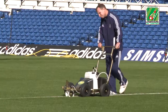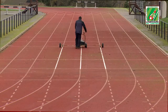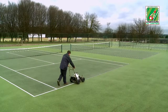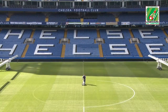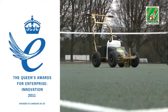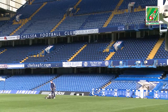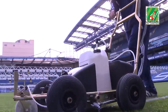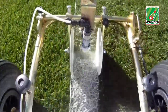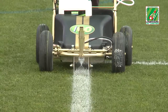Impact XP is the world's most advanced, ready-to-use line marking paint, and raises the standard of sports pitch line marking to new levels of performance. In 2011, the paint was awarded one of the UK's highest accolades, the Queen's Award for Innovation, an award that is unique in the sports pitch line marking industry. This unique, advanced paint is a highly micronised formulation of titanium dioxide, combined with special binders and light-reflecting pigments.